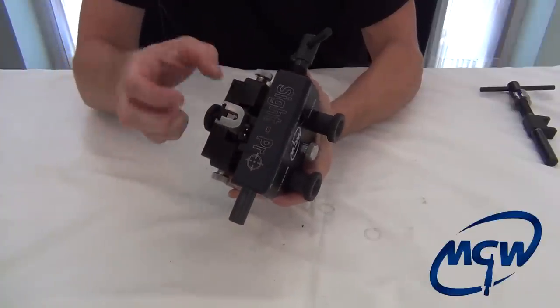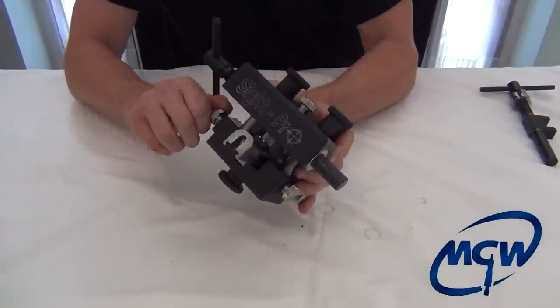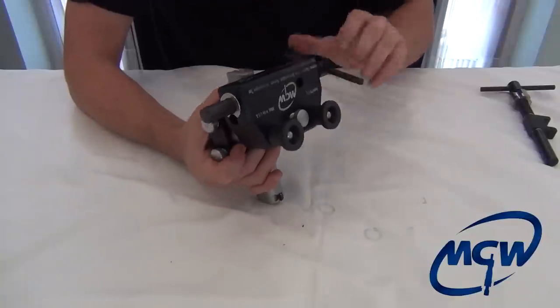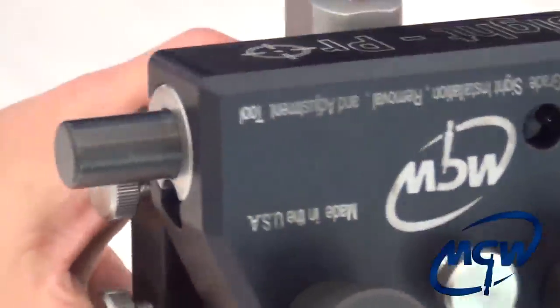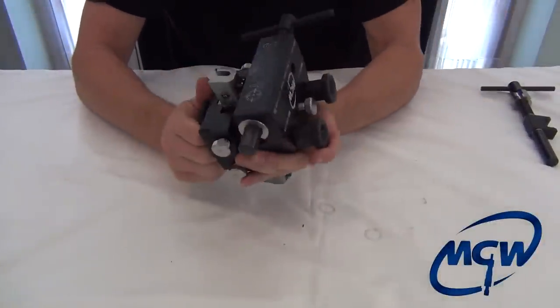The shoe is in the rail — that keeps the slide down. You have the side pads locked down, keeping the rails protected and the slide protected against cracking if you have a really tight sight. With your set pad established, just start turning. You have a lot of engineered force built into this tool, making it very easy to remove even a really large rear sight. Do a couple more turns, push it forward to break it in the center, and you are done.